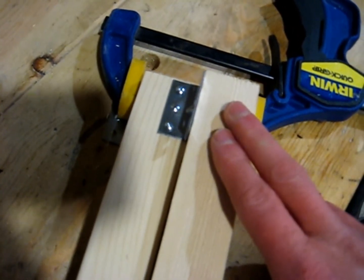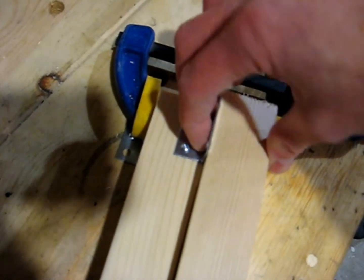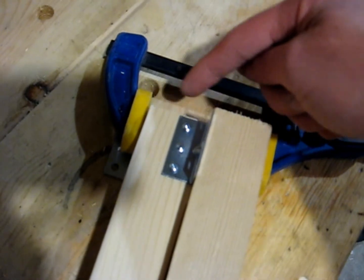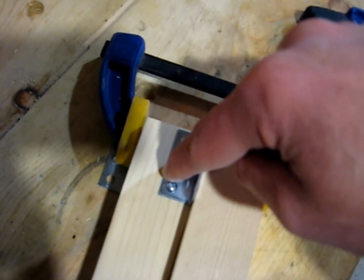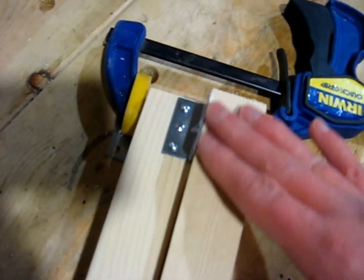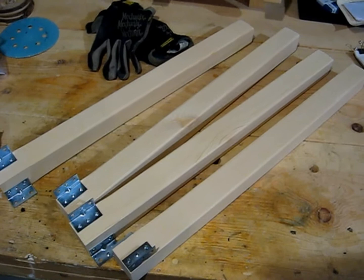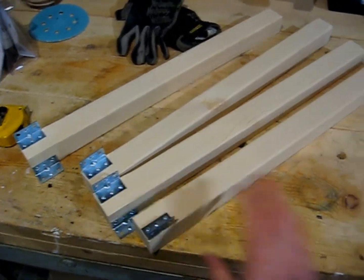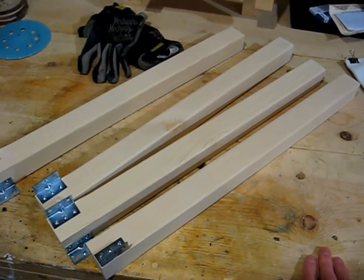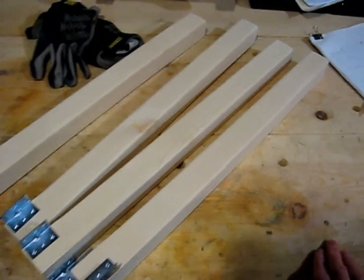I'll show you how I'm installing the brackets. To make sure they're flush with the edge of the leg, I've got a piece of board here that's taller than the leg, clamped to it, so when I put the bracket up against it, it can't go any further — I know it's exactly flush against the leg. It doesn't matter if it's up a tiny bit, maybe a 16th of an inch above the edge of the leg. I just found another advantage to using these brackets: when I put the chair up against the table and realized the legs were a little too long, I could easily take them off and trim about an inch and a half off the bottom of each leg.